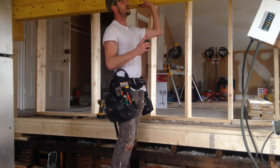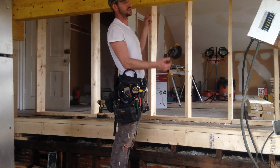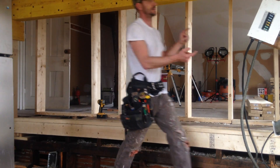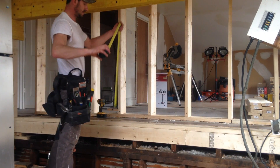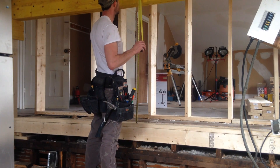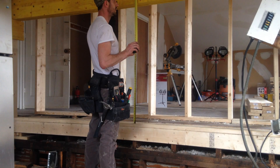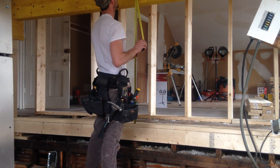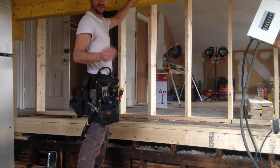Next, we're going to put this up into the ceiling. We're going to smack some posts in, just to raise it up high enough. The best thing to do is get some beams that are relatively a little longer than needed, smack them in until you can get it up. They don't have to be perfectly level because we're just putting them in to hold this tight against the ceiling, then get everything level from there before we put in our posts. This one measures forty-eight and three-quarters, so we'll go forty-nine and a half — because there's a gap, we want it just a little longer so I can smack it in and give it support.